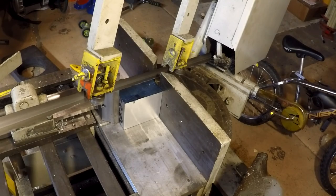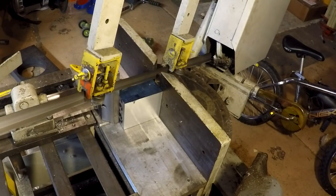And you're gonna let it fly. Now, we have two different kinds of material in here. We've got aluminum, which normally calls for a very fast feed rate, a very fast band speed. And we have a fairly robust steel, nothing hard, but we have 1144, which would call for a slower speed. Well, when you're in mixed mode like that, guess what? You use the slower speed for the material and just set your feed accordingly.